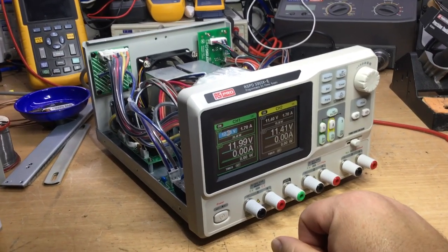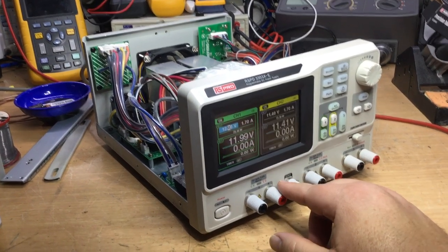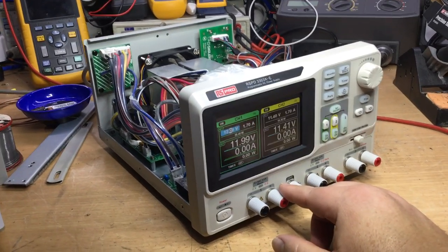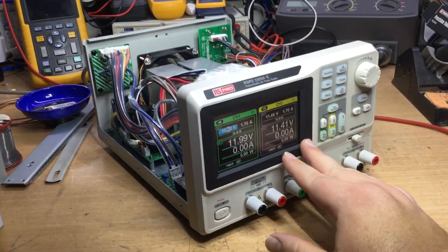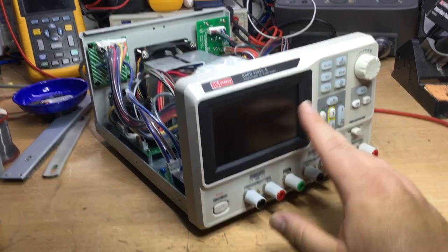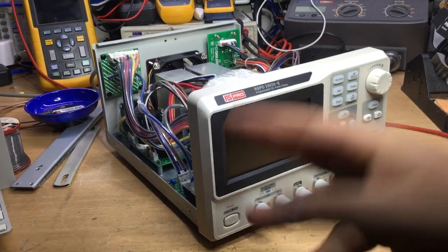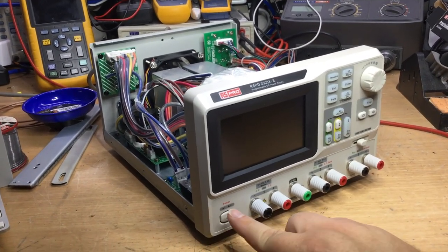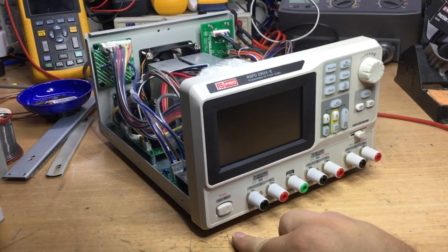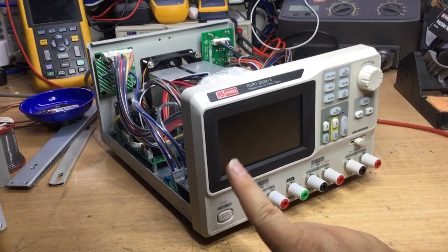I can turn it off and then turn it back on again and it'll reboot and find itself. Seems a bit strange, but there comes a point where it'll switch off and then it won't come on again at all. So it's just gone off by itself there. The fan stops, obviously, and the relays all de-energise. So if I switch that off and then back on again, let's see whether it comes back on. Now, it's not doing it now, you see.